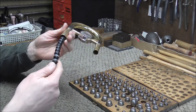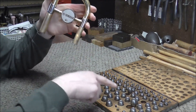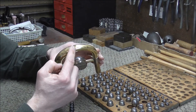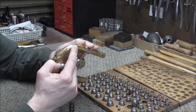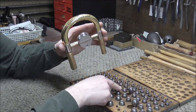Put the dent ball driver into the slide and then push down on it. If it does not go through, you can always use the next size smaller on the dent balls. The dent ball I was using was getting hung up on some of the larger dents and wasn't making its way over to here. I want the dent ball to go up to where the dent is on the smallest part of the tubing, so I'm going to go a few sizes smaller.